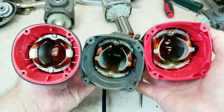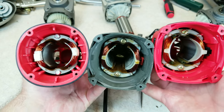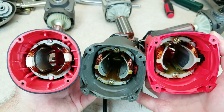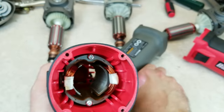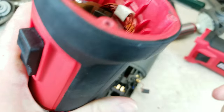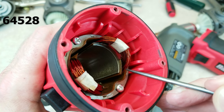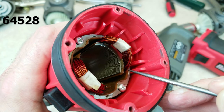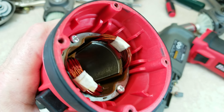On the field windings, none of them are epoxy coated — that's something we see on more expensive tools. There is a difference on the 64528 that I pointed out in the last video: some wires in there are not very well secured. There's a wire that's just kind of flapping in the breeze, so vibration from the tool could cause it to break and cause a failure.